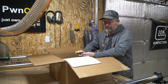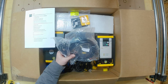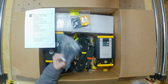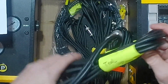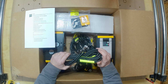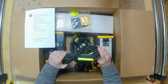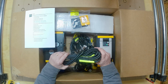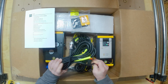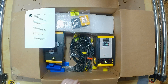Getting into the cables, we have a pink one — pink is a run safety cable — and we've got a couple of power cables: one for the VFD and one for the pneumatics enclosure, marked with teal. This teal one is the spindle power cable, a really nice high-quality flexible cable that's easy to put into a drag chain or anywhere else.